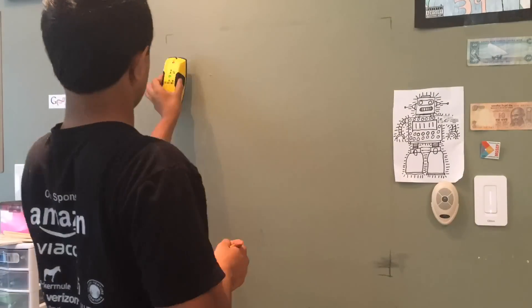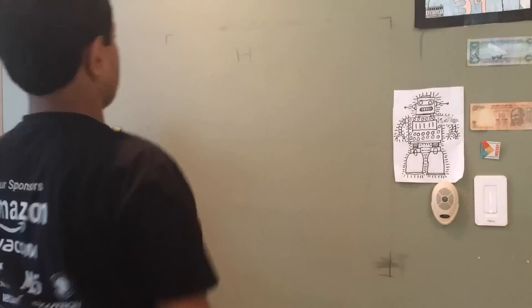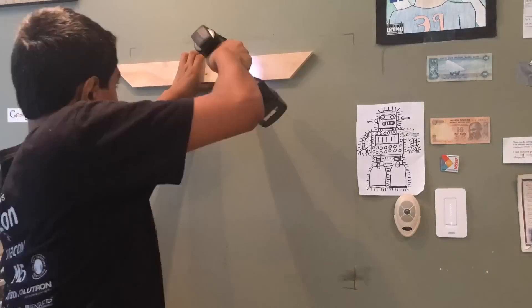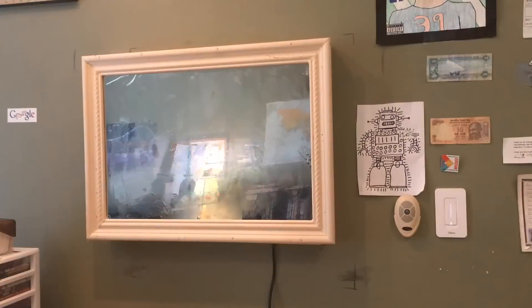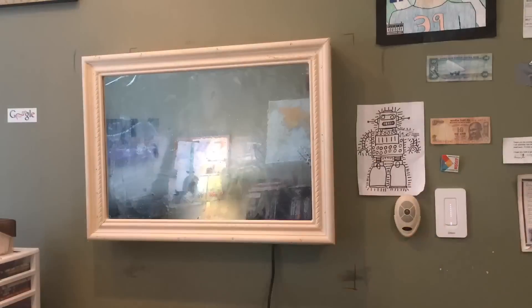The rest of the magic mirror setup can be done from your computer — the programming part gets a little terminal intensive, so I'm going to leave all of that on the project page in the description below. To find out where to mount my cleat, I used a stud finder on the wall and found the studs. I then cut a small cleat out of a leftover pine 1x4 and secured it to the wall using two 4-inch screws. After that, I stuck the whole mirror on top of the cleat and used two 4-inch screws from the very top to drive it down into the cleat so the mirror would stay secure on the wall.